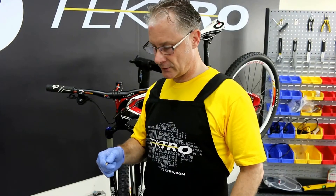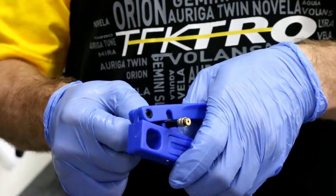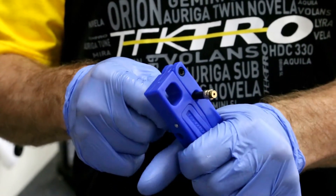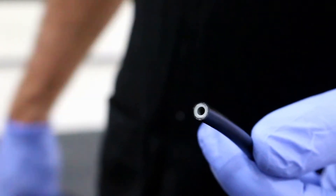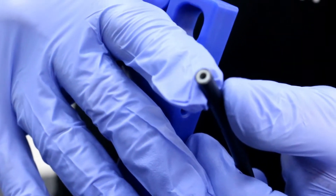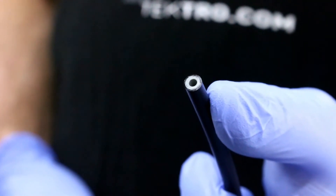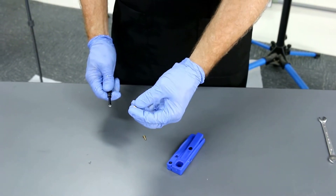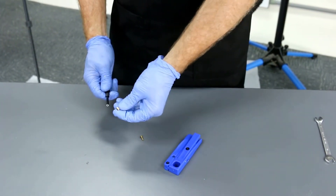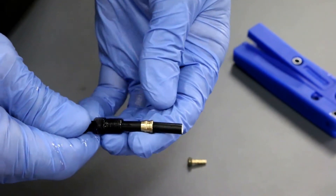After checking for length, use a hydraulic hose cutter and cut like so. Your hose cut should be flat and very clean to make sure proper fit. Next, take your compression ferrule, making sure that your compression ferrule is facing inward, and slide it over the hose like so.